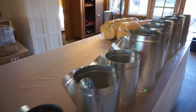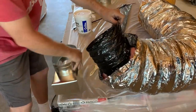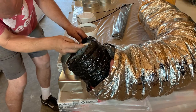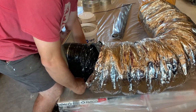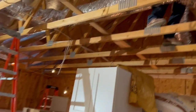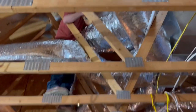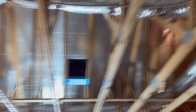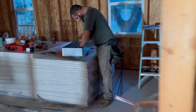Here you see the components. The first pieces are going at the end of the ducts, and those are for teeing off other ducts. Here you're going to see my dad put it together. He starts with this goop, applies it to the inside of that inner duct all the way around, then carefully slips that inner duct around the end of that box. To secure it in place, he takes a zip tie and pulls it very tight to keep it in place. We were a little bit over our heads as far as the timeline, so my dad enlisted some help from these gentlemen, and you can see them run all of the ducting across — it's quite a nest of nastiness, but it all does make sense.